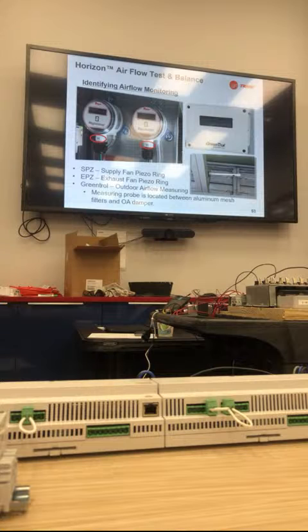Yeah. Well, just for example, if I want to test the exhaust fan with the exhaust fan actuators on it, first thing I do is I go to TD7, override exhaust fan on, override exhaust fan dampers on. Those can get flip-flopped here at the factory, and you'd never catch it unless you did one at a time. But if you're trying to test everything real quick, you override those both on, it gets to the field, and when the program's trying to control it, it doesn't work properly.